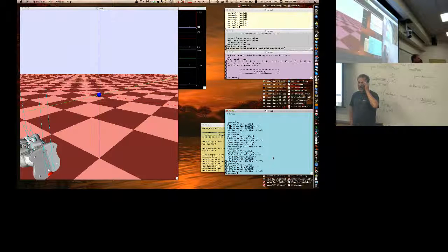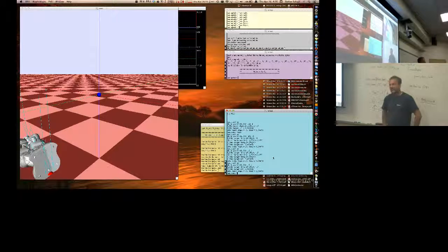And I think for the real robot, for this task, which is actually just moving the center of mass, it's not a huge amount of movement. It's a very small movement. We will most likely not use any form of inverse dynamics, since I don't think the inverse dynamics does something useful on the robot. It cannot be controlled with inverse dynamics in a reasonable way. So we'll just use PD control. So it makes it even easier. You'll see in homework assignment 3, in the bottom of the run part of the function, there is actually a call to the inverse dynamics, which makes it move more nicely. But we most likely leave that out for this project.